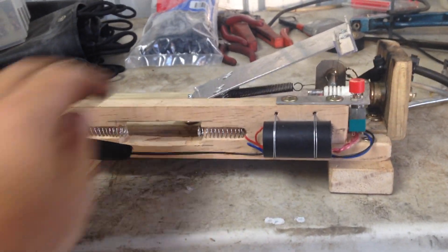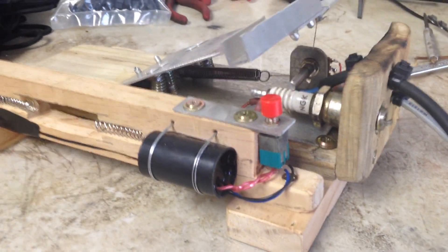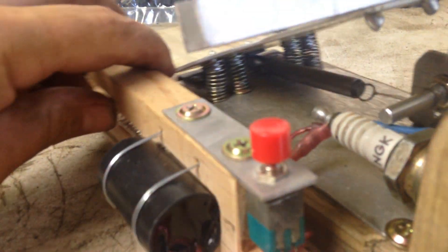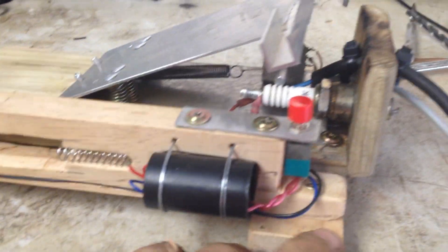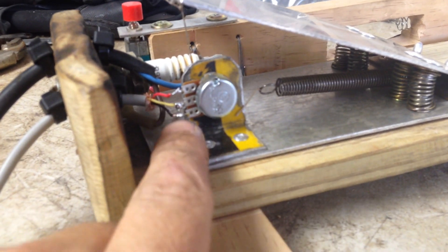What I've got here is the poor man's TIG pedal. So far it's cost me $6. Everything else I've just pulled out of parts. I've got a little 1K pot in there and that spring pulls the string a couple times around it and just moves the pot. There's a lot of little springs in the back, an old door hinge, just a bit of aluminium, an old sign, bit of timber, a couple of feet. Just a little pot.